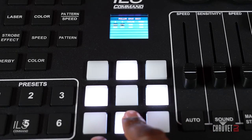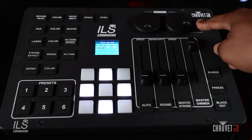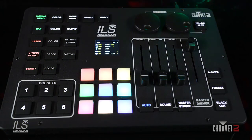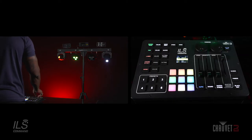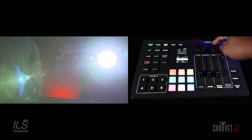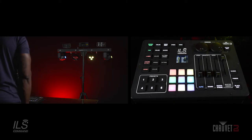With the pad, you can go down to set your second point. When you're done, you hold the follow spot button and use the X encoder to save this program. Once your show is going and it's time for the grand entrance, all you have to do is press the follow spot button, and it will grab that single moving head from the show and highlight the entrance. You can use the Y encoder to dial into your second point. Once that's done, press the follow spot button again and the moving head will go back into the program.